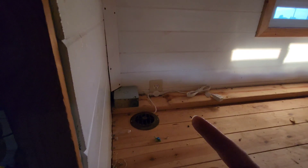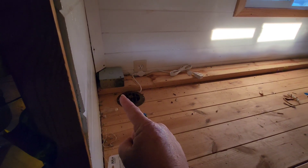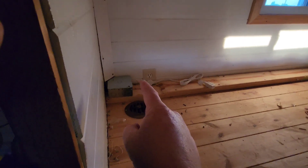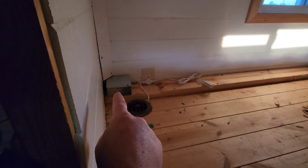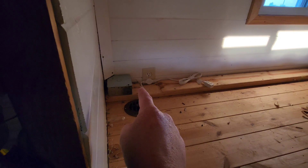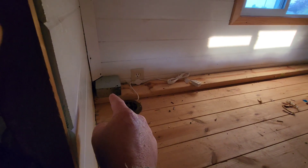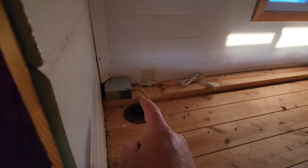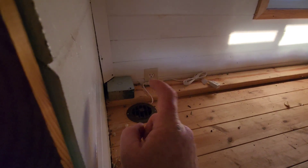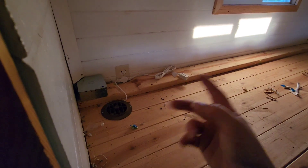This was actually because of a mistake with that outlet. While I was putting this board back in, there was a screw right under the corner of the junction box for the 120V — that's the box I put in to reorganize what was originally just laying underneath, which is really unsafe. I put it in a box, it's grounded, and it's got a plastic insulator where all the wires run in. But while putting this board down, I accidentally screwed into that 120V line running from the junction box into the outlet, so I had to pull the whole thing apart.